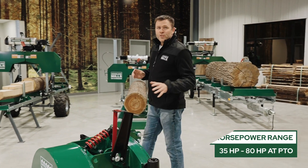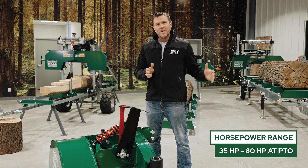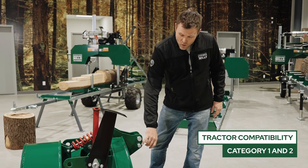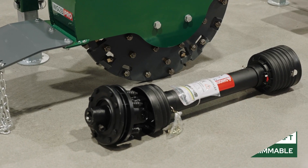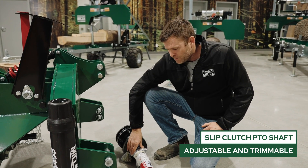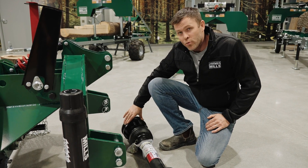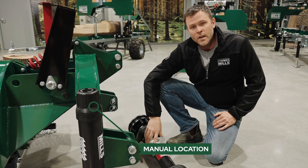The WG28 Pro was designed for a horsepower range between 35 and 80, and because of that wide range, we've included both Category 2 and Category 1 holes and pins. With this wide horsepower range, we include a 7-series PTO shaft that's telescopic in length as well as trimmable. It has a twin clutch design, which mounts to the six-spline connector. This clutch has a break-in procedure, and all that can be found in the manual that comes with the stump grinder.